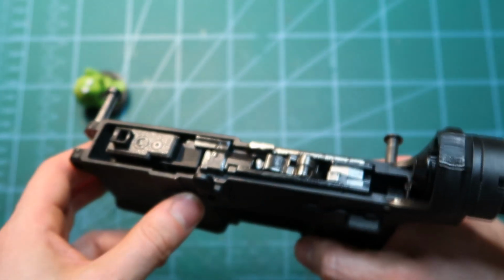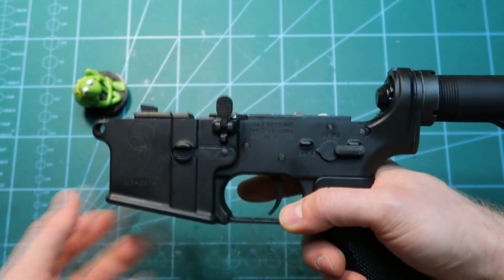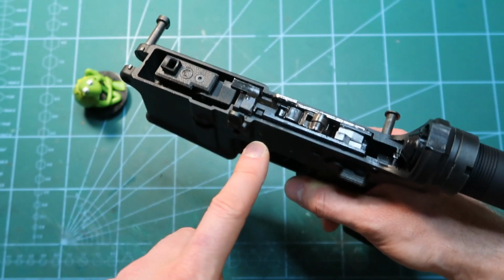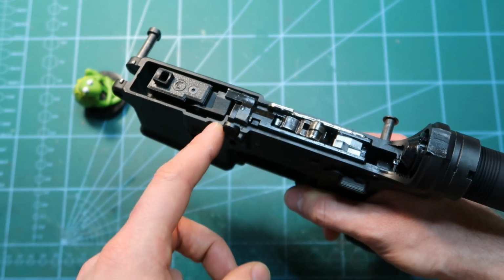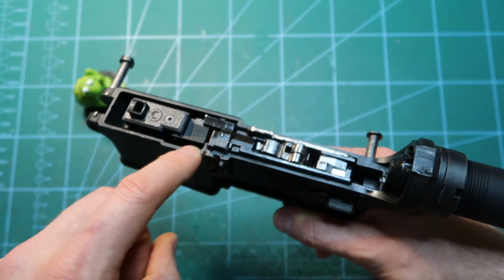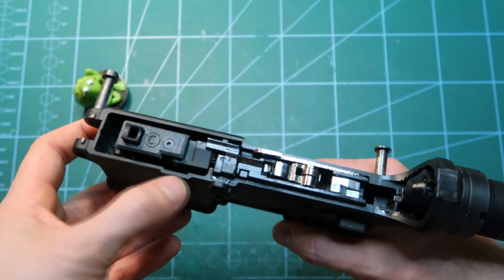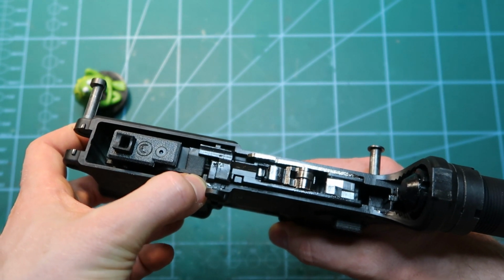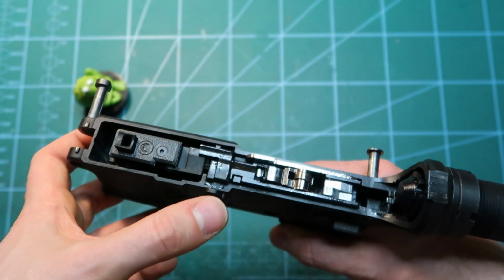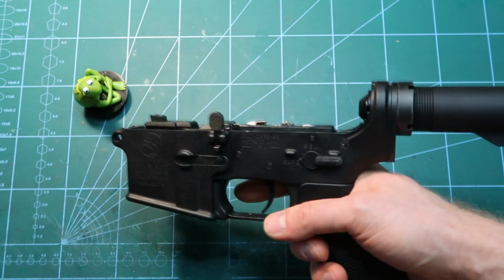And a thing to watch out for here is that right now the trigger box can be pushed up a bit by the conversion, depending on your tolerance during assembly. So for this reason you must make sure that when you are assembling the upper, everything's fine here, so that you don't push with the upper on some rib somewhere that prevents you from locking the rear pin or something. In my case, this rib here in the front was a tiny bit too high, so I needed to file just a bit off, and now it closes easily.